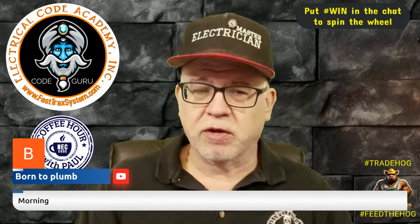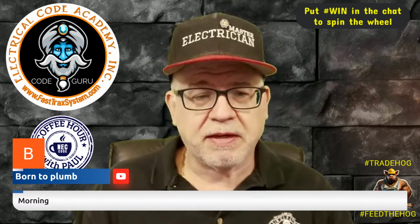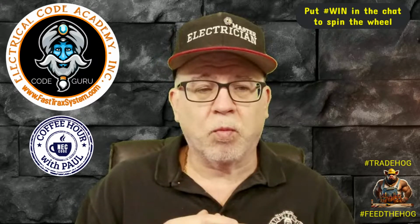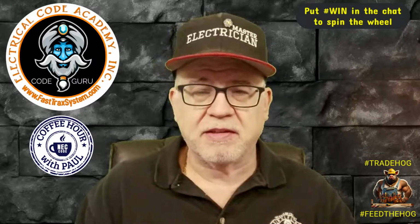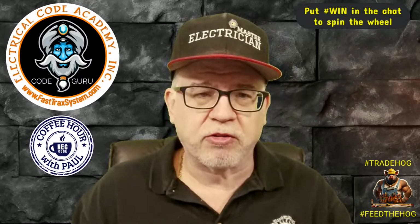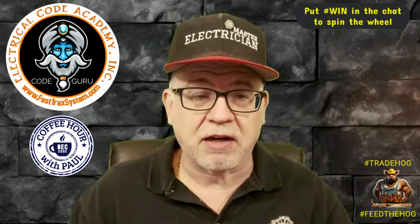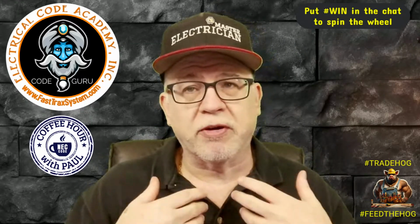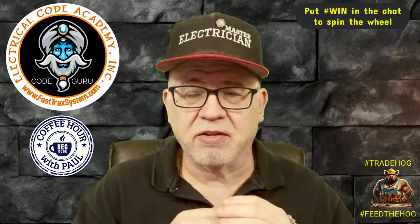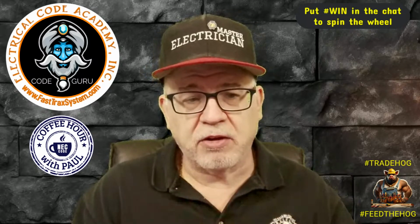Born to Plum, I did get your question. I will cover it on a podcast, but typically for those boxes that are part of a listed product, there's no stamping on them. What we refer to is the manufacturer's instructions, which are part of what it was evaluated for. So when we think of metal boxes, we're pretty much bound to 314.16 for those standard type boxes. And non-metallic boxes will post the cubic inch values and things like that.